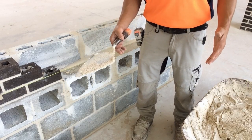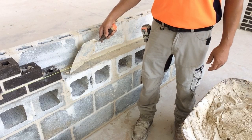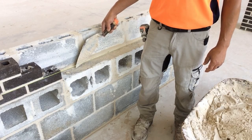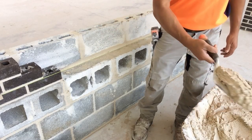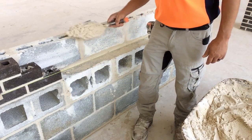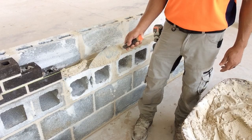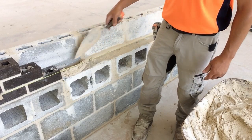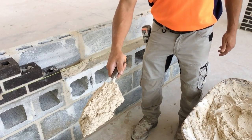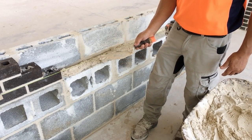This is where it gets a little difficult right at the very beginning. I have a brick here and the brick shelf right here. I want this area to be full of mortar when I start spreading. I form a loaf — I'm going to say a baby loaf — and I start right at the beginning. I plop that down; this area here is full. We're going to come back to that area after we spread the entire length of the wall. Now I can do bigger loaves on the blade. As I'm spreading, we're trying to avoid the string line.